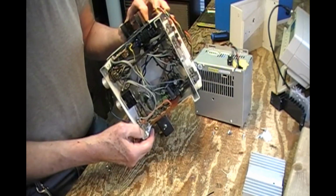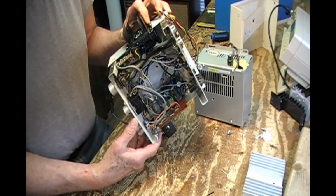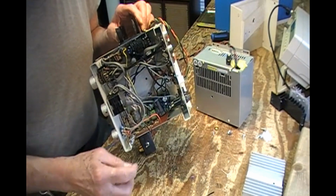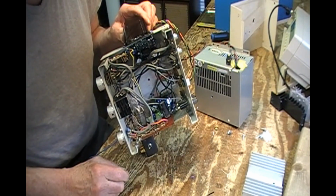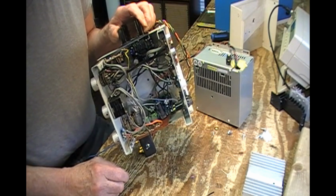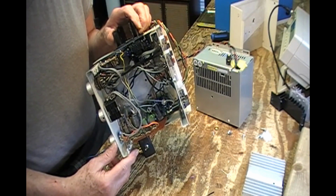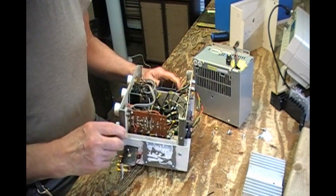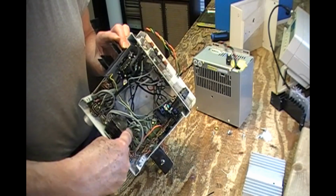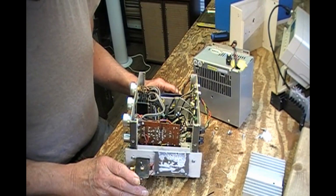Of interest to absolutely nobody except me, this board was my first and close to my last foray into making PC boards. And what is it? TL, gee, I forget what they are. TL074s, pardon me. And they are 4 op amps inside one, and they're FET. They were very popular in the late 70s, early 80s when I built this. And I built this, part of it, with wiring going out to off-board bass and treble controls. I built that for disco use. I think I mentioned that as well too.